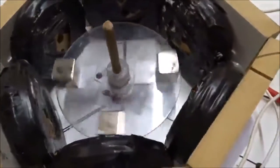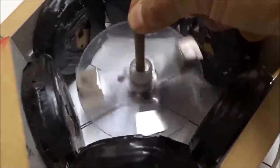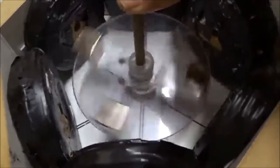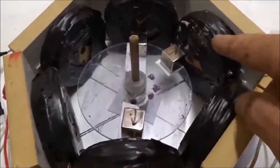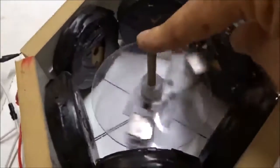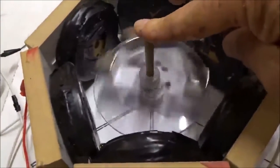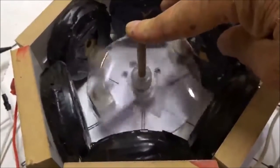That's cool, isn't it? Let's turn it up a little faster. Like a robot — very tight magnetic locking. Let's go a little faster. You can't really magnetically lock any more nicely than that. That's what you call a synchronous motor. Next, we put a third magnet at 120 degrees on U and W. Put on a couple hertz, and now we have it move anti-clockwise. Self-start anti-clockwise with locking, but not quite as tight as the 90-degree arrangement.